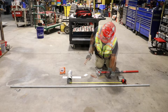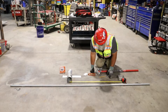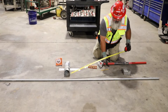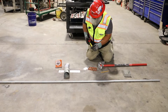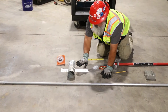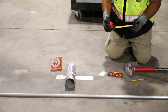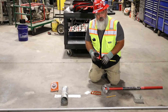We're going to need a pencil and a nice level — magnetic preferred — with a 45-degree angle. We've got our starting point measured out from the center of our obstruction. Our obstruction is 40 inches away from where our starting point is — the box — 40 inches away from the center. The height we're going to deal with is right at four inches. We want to make sure we have space over this, so we're looking at an obstruction a little bit less than four inches, but we're going to bend at four inches. Always go up a little bit to give yourself space so the pipe doesn't touch whatever you're trying to jump over.